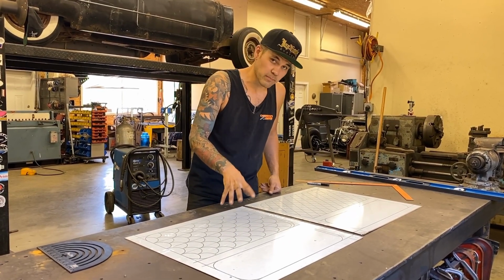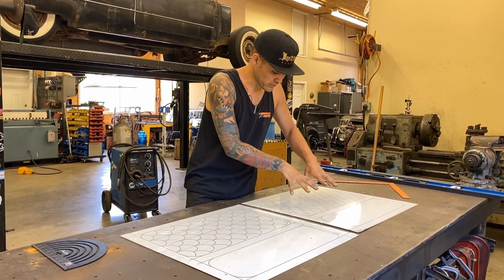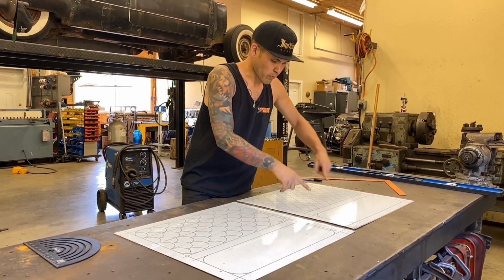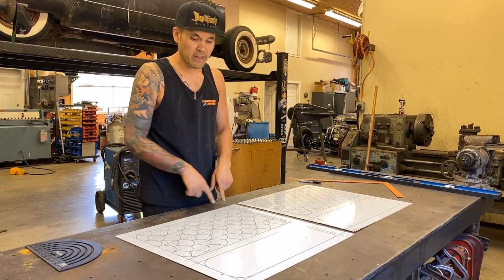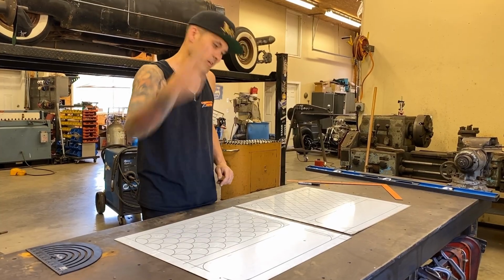We're going to use that same step wheel to make our scales. So basically I'm going to do this first, that center piece. We're going to switch the dies to the step up dies and go around our borders. That one will be done. And then we're going to do all of our scales, keep the panel as flat as we can, and then we'll step around the borders of the scale panel. Let's go to the bead roller.